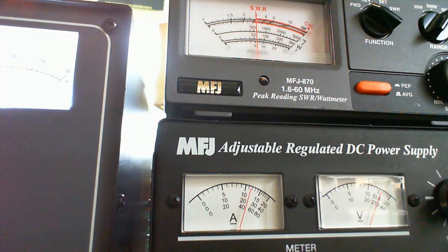The grid is at about 140 and the plate is at 600. With the tubes swapped out, the limit on the plate is 750 and the limit on the grid is 200, so we're well within the grid and plate maximums for the amp. I'll turn it up to 95 just for grins, but I don't think we'll get much more. Yeah, still about the same. Driving it at 75 watts gives me about the max power out — right at about 600 watts.